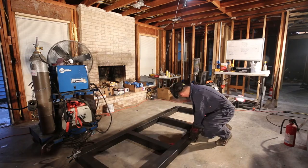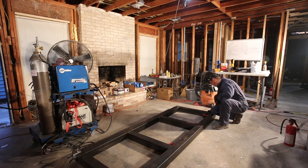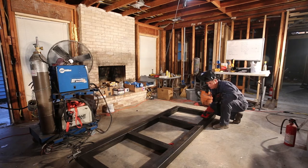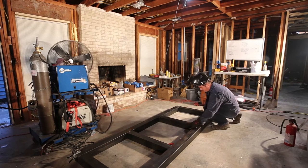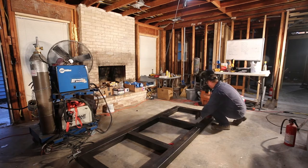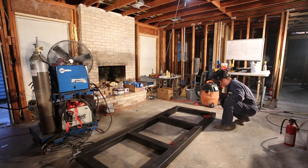It takes me a little longer because I need to first come to the conclusion that it's not just a mechanical mistake and that I can't get the pieces to line up. So I'm going to pull my magnet out of there and pull that side back out a little bit so I can get access to it. Because it's only tack welded I can easily lift it up and pull it out of there.